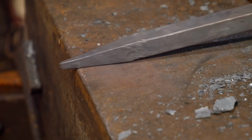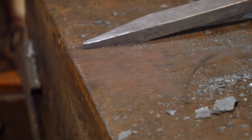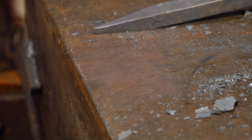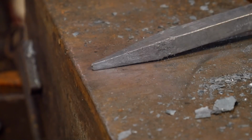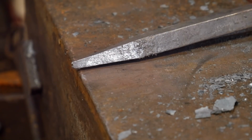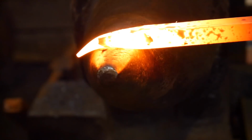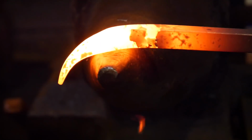Even though you can hammer it and it looks clean, it looks like a clean forging afterwards because you can planish out that surface material, the structure has been ruined of that material. That's why they say if you burn it, just cut it off and redo. So I'll move the camera, we'll get over to the horn of the anvil, and I'll show you what I mean.